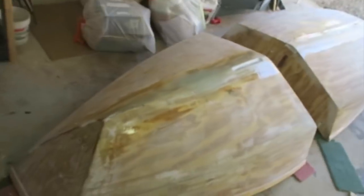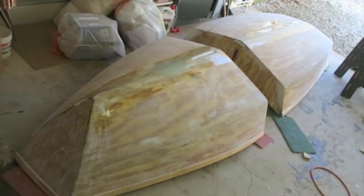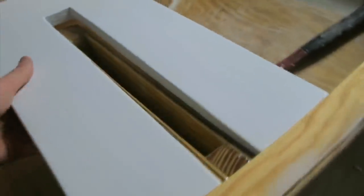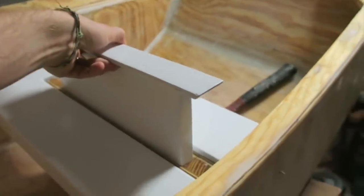I just finished putting two layers of fiberglass just along the centerline at the bottom of the boat. I almost called it a keel, but I don't believe this is a keel — this is the daggerboard slot that I've covered up, and I'll just have to cut that back open. But yeah, this will give it some additional protection when we're dragging this thing up and down a beach. I also got these L-shaped brackets installed to support this forward seat that slides in like that and drops in, supported at each corner and right down the center, with this filler piece plugging up the slot.